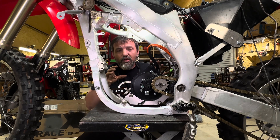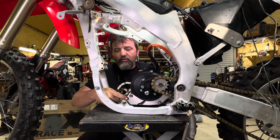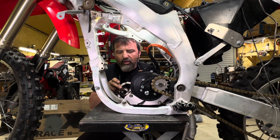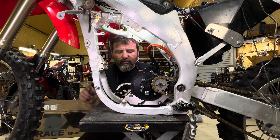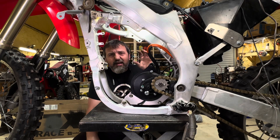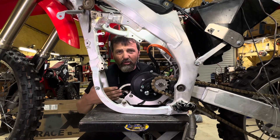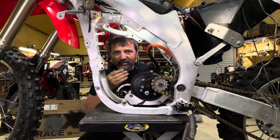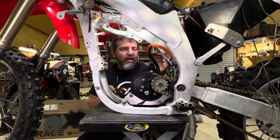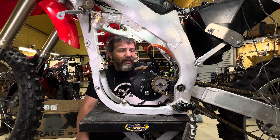But this aluminum spacer here is mainly just taking up the space. There shouldn't be too much torsional force on this, but there's going to be forces pulling everything back and pushing it, so that's something I may look into. I took some factory-sized bushings here — I think they are 20 millimeters outside diameter — and I turned those down to make this. You do not need a lathe to do that. I used a small couple-hundred-dollar lathe, but you could do this with a hacksaw, cut it, sand it smooth — that does work.